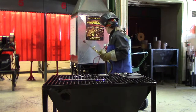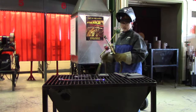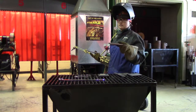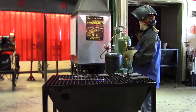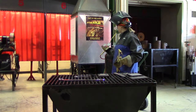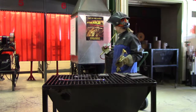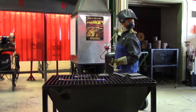We're going to set our oxygen and acetylene for what we're cutting. Today we're going to be cutting three-eighths plate, so we'll aim starting at approximately 3 PSI acetylene and 30 PSI oxygen. Screw the regulator in until it starts to register — 3 PSI. Then turn the oxygen up to 30 PSI.